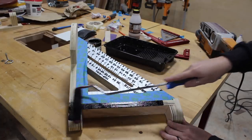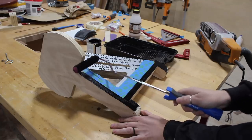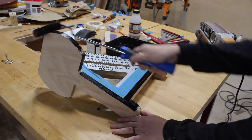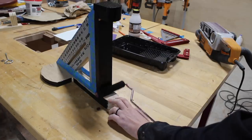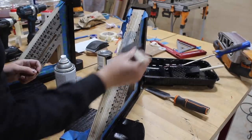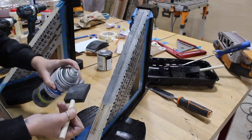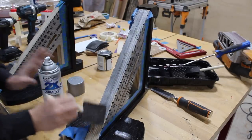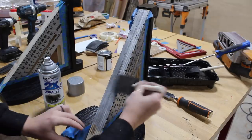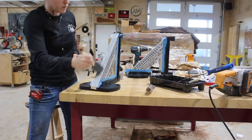After getting the first portion of the mount gluing up I took the downtime to start painting the square assembly. I painted the entire frame black then the rest of the speed square parts silver. A tip: when only working with rattle-can paint but not wanting to tape off everything that doesn't need to be painted, I grab a foam brush, spray some paint directly onto it, and then just dab it on. This has saved my neck a few times and actually works really well.